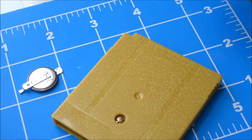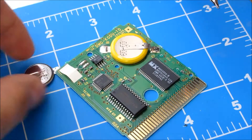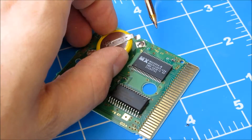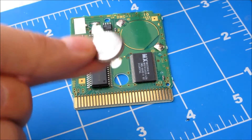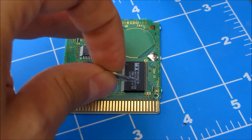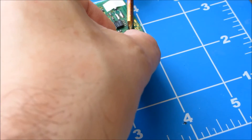We're gonna do the same with your Pokémon Gold here. Remove this one the same way as the other — just pop your soldering iron on the tabs here, heat up and pull. There should be enough solder left on the board for you to install your battery from your sports game. Follow the little diagram here: plus/minus, printed side is positive, slider in, and solder down.